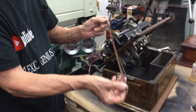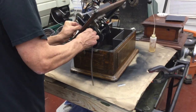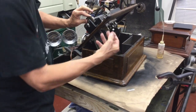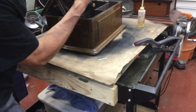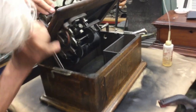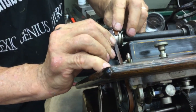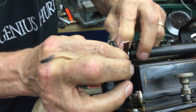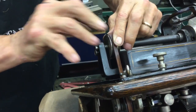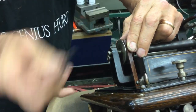I've made the cut and I have the piece. So what you do is you feed it through and wrap it around the pulley, making sure it hits both pulleys. Now I have an overlap — you see this? You're going to bring this up tight, press it down and hold your finger, pull it tight. Then with a straight razor, you're going to make a little mark right there, and that's where you make your cut.